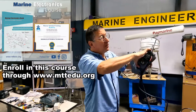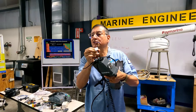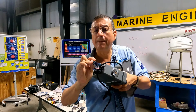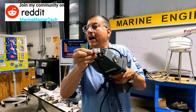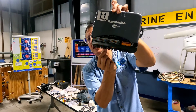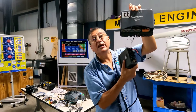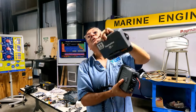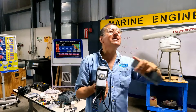Suppose that this radio is not Raymarine — it's another manufacturer. And I have the NMEA connectors. They say that gray is positive in, purple is negative in, blue is positive out, and brown is negative out. And here on the autopilot computer, I have the NMEA option: positive in, negative in, positive out, negative out. So can I integrate the data of this radio into the NMEA backbone? Yes — because this computer is connected with the NMEA backbone. If I connect this radio here via NMEA 0183, now this radio is integrated with the NMEA backbone.